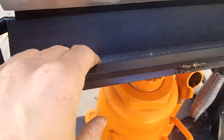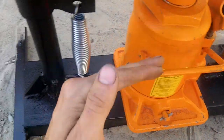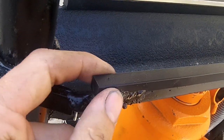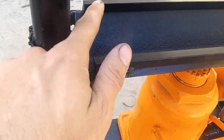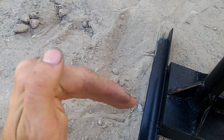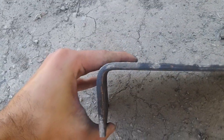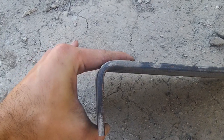Another thing I ran into is I used 3/8 angle steel for the die, and when the metal was bending into there at 90 degrees, once I lowered the bottle jack the metal would spring back to like 98 degrees. So how I fixed that is I got some square metal bar and just welded that onto the lips of the die. Now the die is actually an acute angle and I can push it a little bit past 90, and then once it has the spring-back it's right at 90. I took some 8-inch wide quarter-inch steel and pushed it as far as it would go just to see what it could do, and I got it to stay a little less than 90 — so for sure I can do right at 90, which is what I'll probably only ever do.